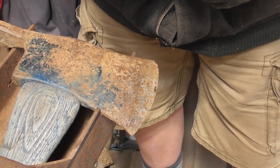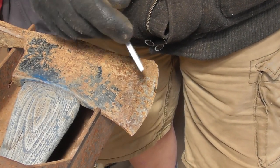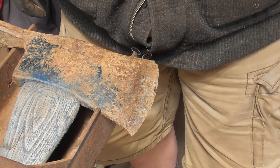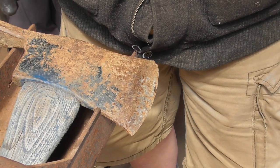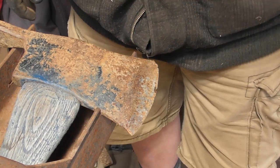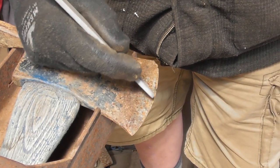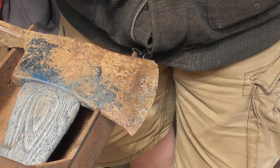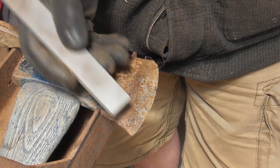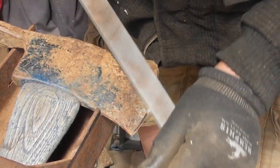When I say they didn't know what they were doing — somebody told them they had to have a shiny place all the way back to here. The only way to get that shiny place all the way back is to file this flat. And you might as well take a two-and-a-half inch wood chisel and tape it to your axe handle and try cutting with that, because this is going to stick. I can probably not fix it enough to be perfect, but it's definitely not going to need filing in this area. It doesn't need it. It needs the edge sharp. It doesn't have a major chip right here, so I'm just going to hit it — sharpen the edge. That's all you need to do with this tool.